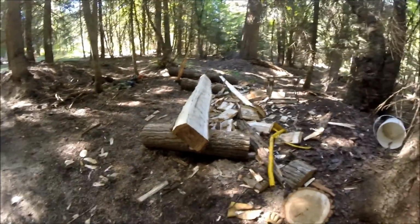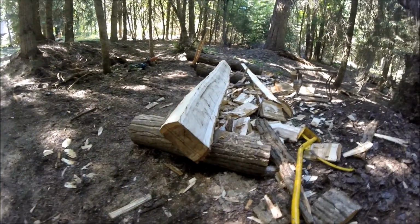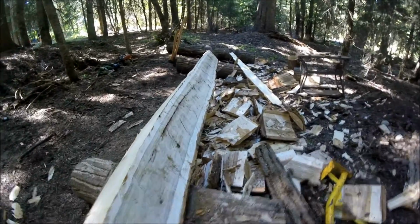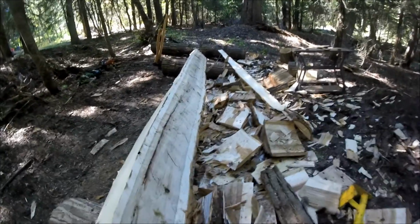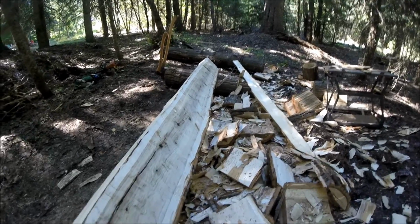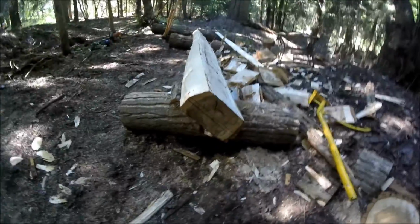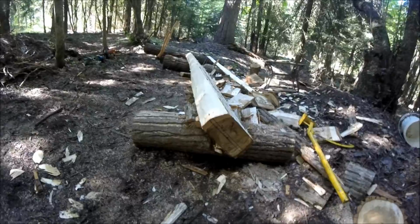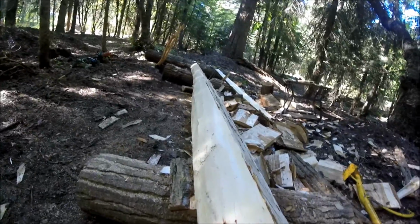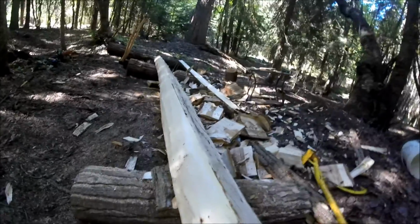Okay folks, here's the finished product, and it came out real good. Now this, I didn't go back and touch anything up. I could take the axe and go back at a diagonal. Like I said, if I had a flat-sided hewing axe, it would even be better. Now, I peeled the bark off, and you can always tell tulip woods because they have that funny surface, and it has little sharp knots sticking out. Log came out real good.